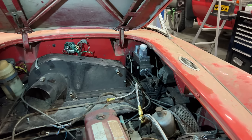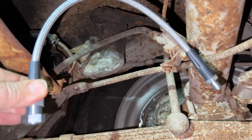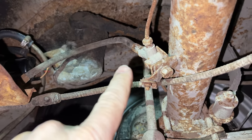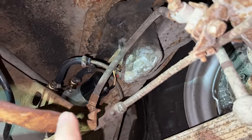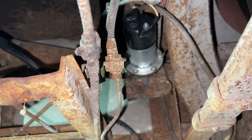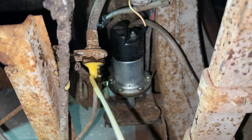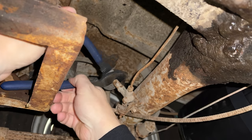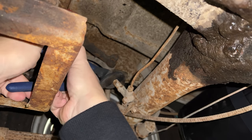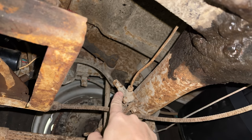With that sorted, I don't want to put any brake fluid in yet until I've replaced the hoses, so I have a set here — these are stainless steel hoses. In the back of the car there's just one hose; the old one goes to a distribution block which then divides off to the two rear wheels, and up front it connects to a pipe. I like to just cut the hose as close as I can to this end so I can slip a socket down on it — it's a lot easier to remove from the distribution block that way.